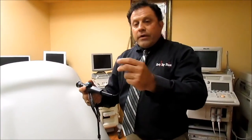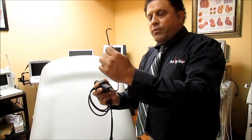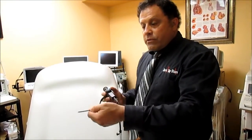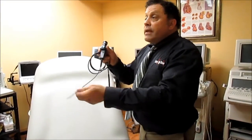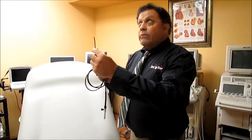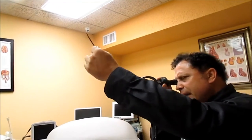There's also an ENT4L. As you can tell, the bending is perfect — it goes both ways. The bending rubber is in really good condition, the insertion tube is in great condition, and it has zero broken fibers. If you look up to the light, it doesn't have any broken dots, which means it's in perfect condition.